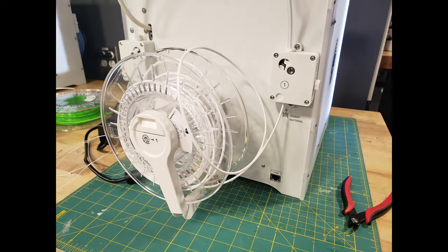Depending on how lucky you are, you might be able to untangle this just by moving a few things around, but the recommended method is to go ahead and unload the filament and reload it. The reason for this is that a tangled spool can often lead to compounding issues, one of which is called a grind-out. A grind-out is when the feeder motor tries to push the filament through the Bowden tube, but it's stuck — either because the spool is tangled or the extruder isn't extruding properly — and the wheels just keep trying to push the filament through but it's not going anywhere, so it ends up chewing it up or grinding it out. Hence: grind-out.